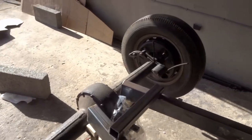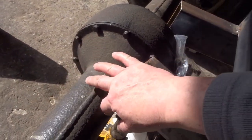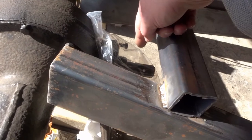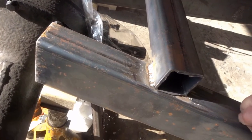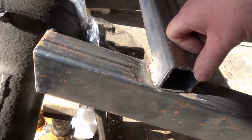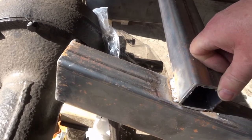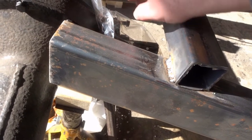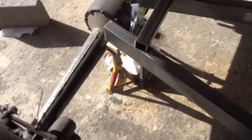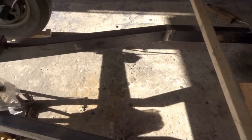The other thing I'll do while I'm waiting for those to come will be to make the plates with the C-shaped cutouts here, which should be welded on. I'm just going to tack weld them because there's a high chance of getting it wrong. This shaft here is going to either be parallel with the chassis tubes — bearing in mind the tubes have a very slight two and a half degree nose-down angle — or if I want my engine level with the ground, which might be better, I need to put a spirit level or angle gauge onto this actual shaft and get it level, then tack weld it all in that position having measured multiple times along each side to make sure it's not twisted, otherwise the car will crab along the ground.